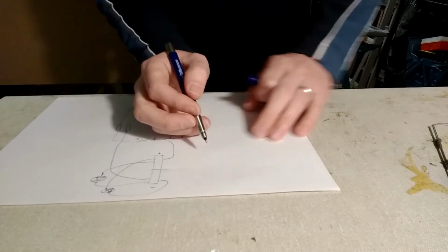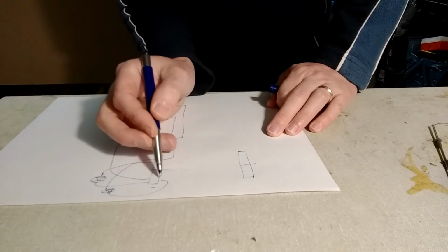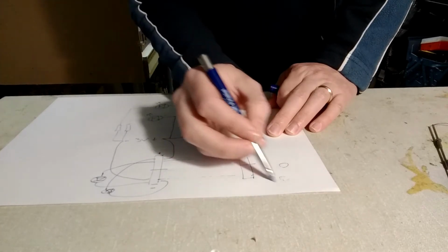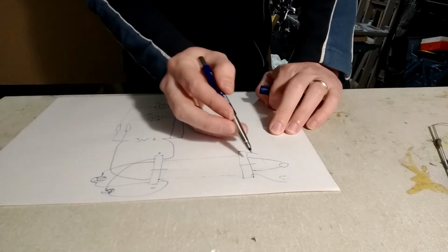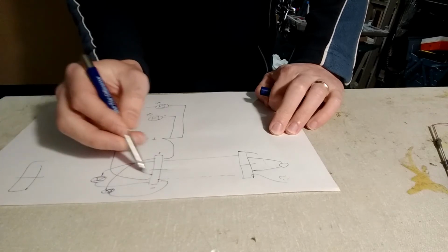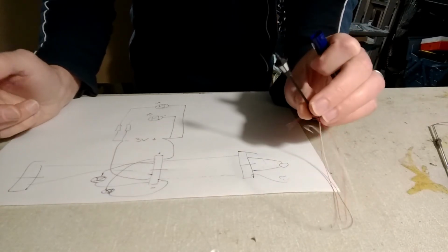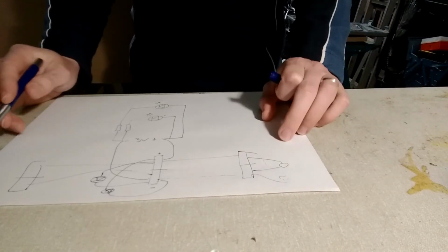The other nice thing about this approach is that I can add another chocolate block connector here, connect negative to negative, positive to positive, and then I can add yet more LEDs this side. And by doing this around my layout, putting different chocolate blocks across my layout like this, it means that the wires from my LEDs don't have to travel as far. What I'm essentially creating here is a 3-volt bus into which everything can be plugged.